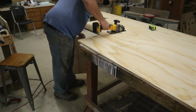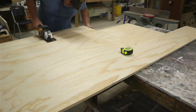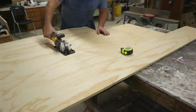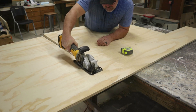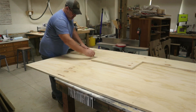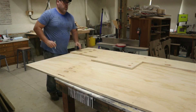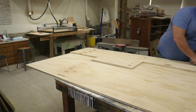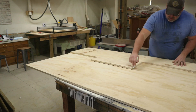I use it all the time — it's really good for cutting plywood. Now because the saw blade is round, when you get to the corners it tends to leave a little chunk. So what I do is get a handheld battery-powered jigsaw and clean up those corners so that when I'm ready to set the top on there, it sits in nice without a weird notch of wood that makes a gap. After making all the cuts, I traced the side I had onto another piece of plywood and proceeded to make all the cuts for that piece.